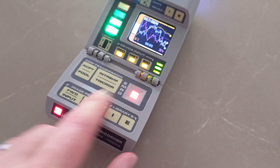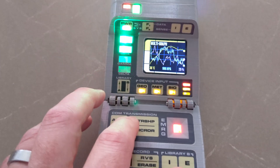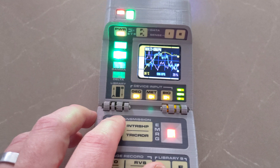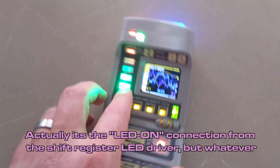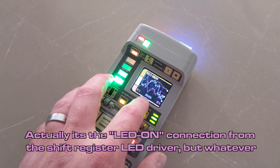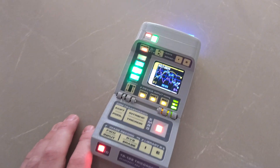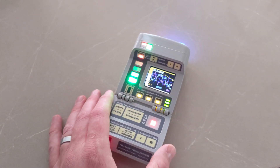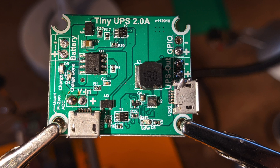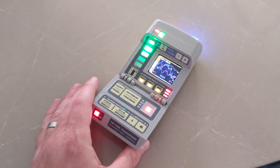There's a battery in here, some LEDs. I'm running three wires — battery voltage and ground — and then I pass back another plus five from the battery discharge recharge circuit that's separate in here. I actually had a bit of a problem with this one when I built it: I left some wires just flapping around and actually fried my power supply, so I'm just using a cheaper one from eBay right now.